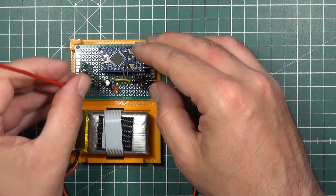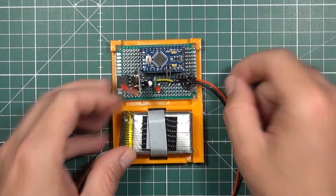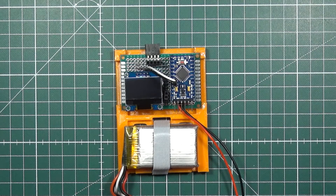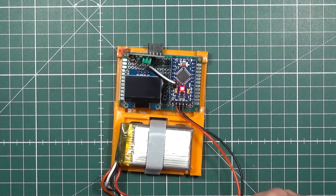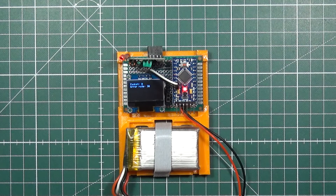For the transmitter unit I used an Arduino Pro Mini flashed with the VirtualWire library, transmitting every 200 milliseconds — a number from zero to 255. On the other side, the receiver tries to receive and decode the signal and gives me basic information about any lost packets. Since each packet carries a sequential number from 0 to 255, I can count packets and determine if anything was lost.